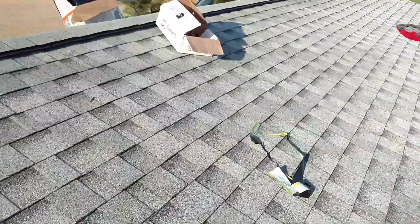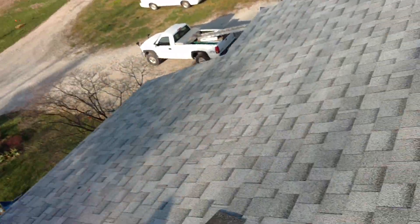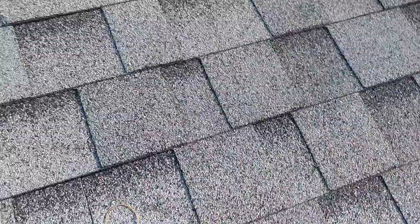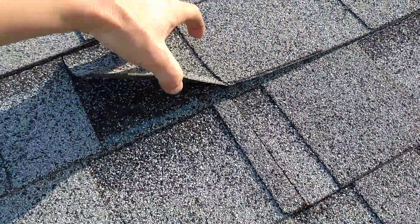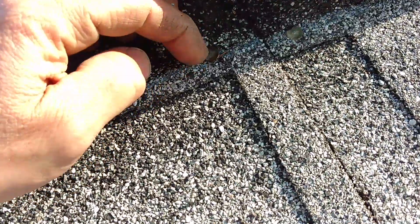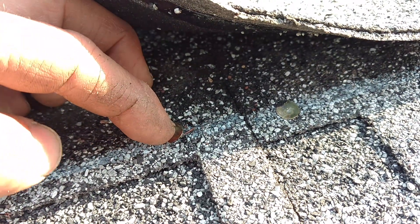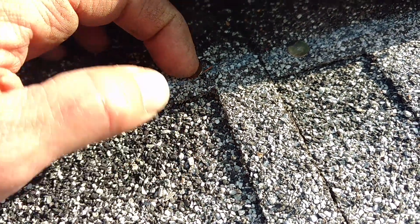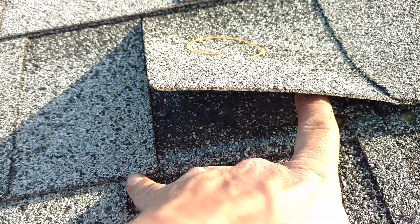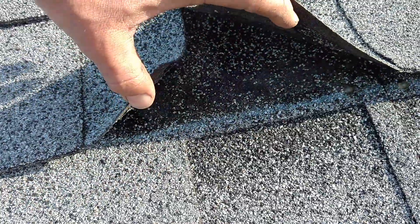So there's a spot. You don't want your nails right at the edge — see if you can see it a little better. You want them in the common bond, which is what's between the laminate and the top part. It's kind of hidden under the headlap. Now, your drip groove is this section here. Water will penetrate through this, so you don't want nails in that area.